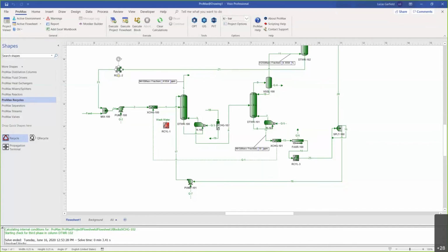There's a question about whether you could use fuel gas stripping. You certainly could. You could try to use fuel gas stripping. I think that the challenge that you would have with using fuel gas stripping would be figuring out whether that fuel gas was going to be problematic in your overhead stream or not. Would you want that fuel gas to end up in your SRU? Would you want that fuel gas to end up in the overhead of your ammonia stripper?